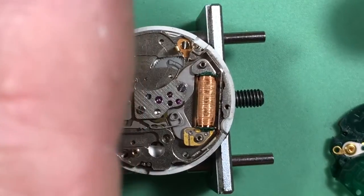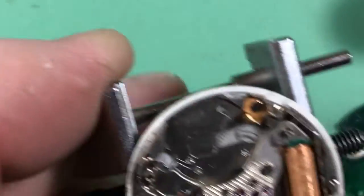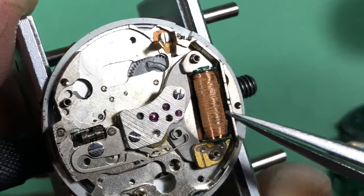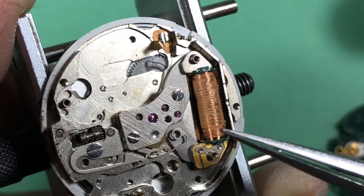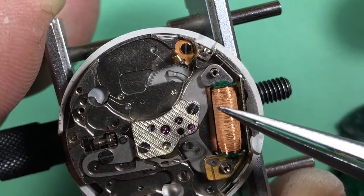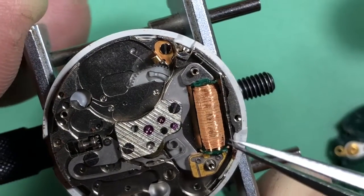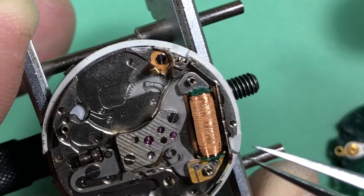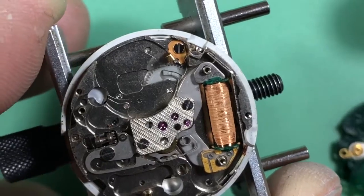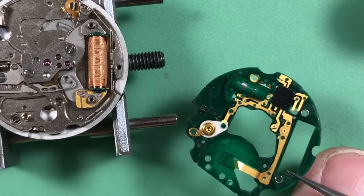Yeah, it definitely got some cold solder on here and some popped threads. Just for the fact that we got the cold solder on here, it's no bueno. And this isn't even a 7549 coil that doesn't have the plastic wrap on it. The 7548 replacement. And it's got this big old janked wire on here. This thing shouldn't be running at all. And something like this, where you're relying on cold solder to keep it going, it's dicey. So I would strongly recommend we get rid of that and swap it out with a good one, because I do have them.